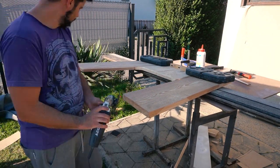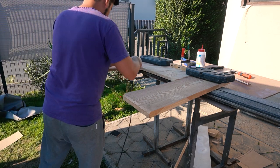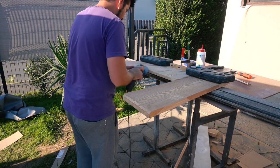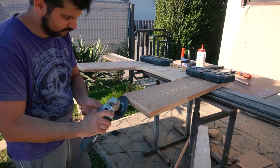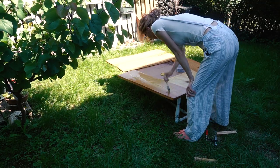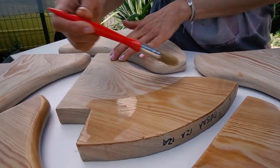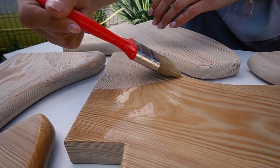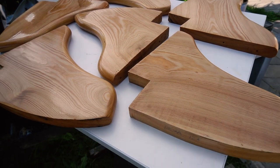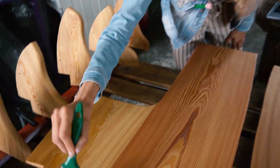And what makes me happy is being able to finally finish this rear bench. And after the final grinding, we first need to paint the wood parts with D1 oil. We decided that these parts will have a shiny finish. So after painting them with D1 oil, we need to paint them with D2 oil. Painting with D2 marine oil requires 6 coats at 12 hour intervals, so we had to paint it indoors. Luckily, there was a storage space nearby we could use.